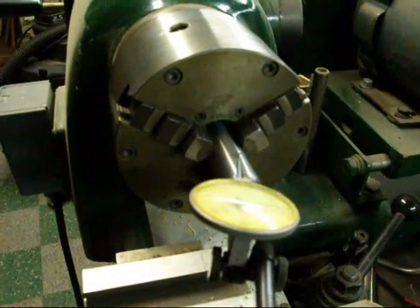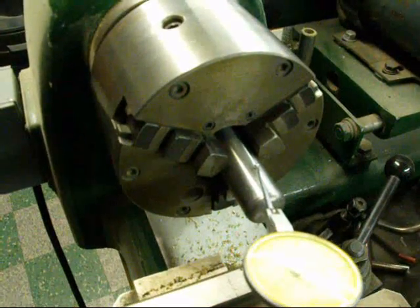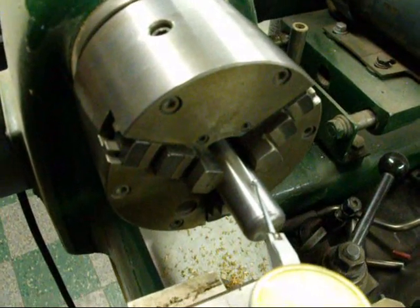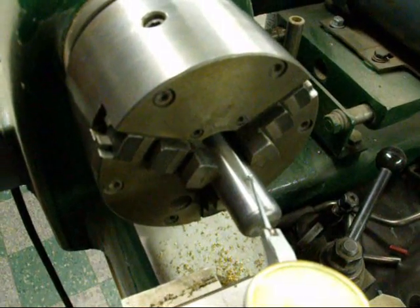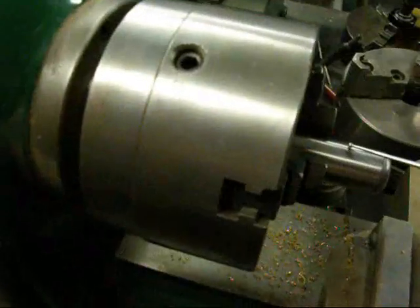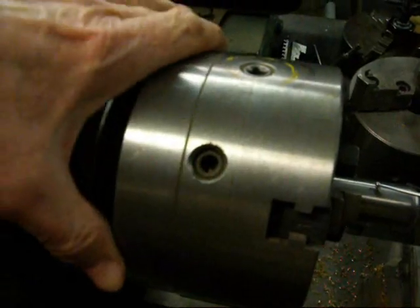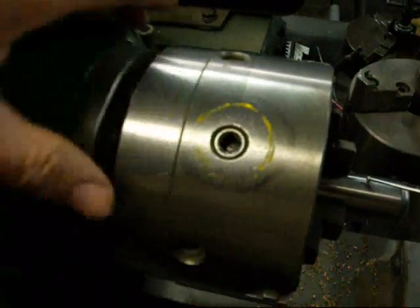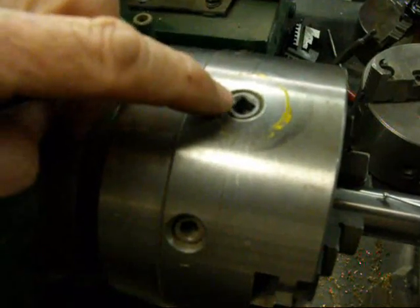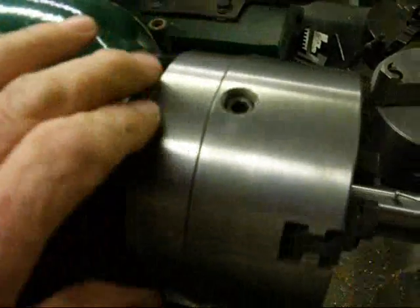That's a project I might attack someday. In other words, it's a chuck that can be recalibrated back to a true zero. It's not an easy job to do — you would use an indicator to do it — but that would bring this back into really true zero. Some of you may have this kind of chuck. You can tell if it's an Adjust-A-True chuck by how many bolts you've got out here. Don't confuse them with these three — this one only has two. Don't confuse them with the chuck tightening screw. There will be other bolts out here, and don't touch those unless you intend to recalibrate your chuck.